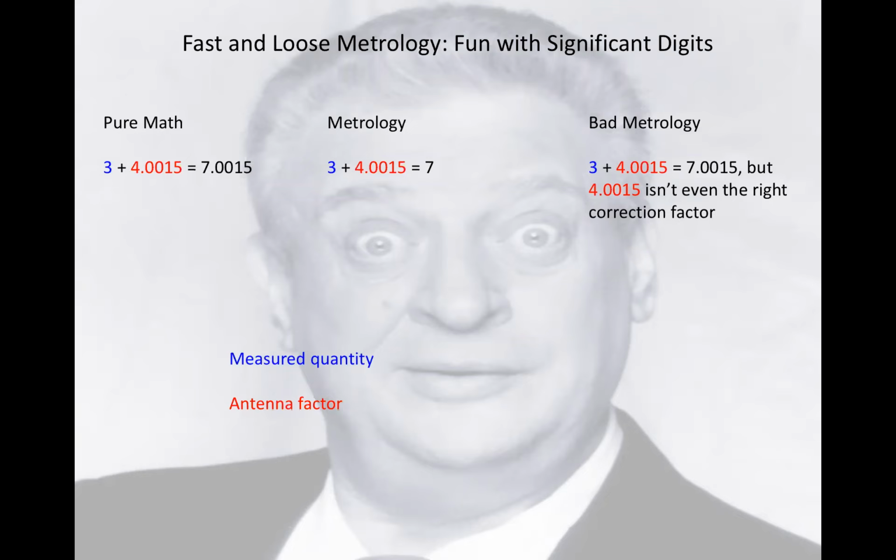It's taken us 30 years to get the latest version corrected for basically the Ford transients, which are more realistic. So as you know, it's a heck of a long process. Right. But at least nowadays you have CISPR 25, 1995, and I probably missed several updates in between, but I think most of these things are on 5-year rotations now. If there is an error, it doesn't need to sit there for 30 years if people recognize it. Well, unfortunately, it does. That example I gave is off the subject of this meeting, but it has to do with automotive transients. There have been these ISO transients out there for years that are totally unrealistic. Ford came out with a more realistic way of doing it, which is in their spec, and they finally adopted it after, honest to God, I'm not exaggerating, it must be 30 years. They kept the old, but they added the new. So it's painful to get these things changed. Yeah.